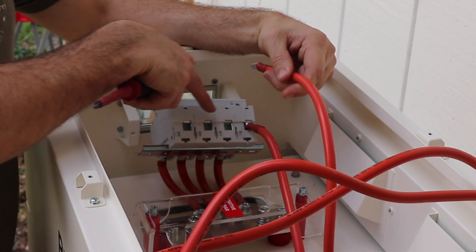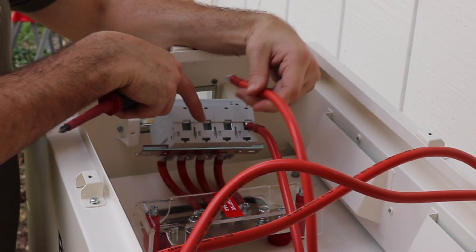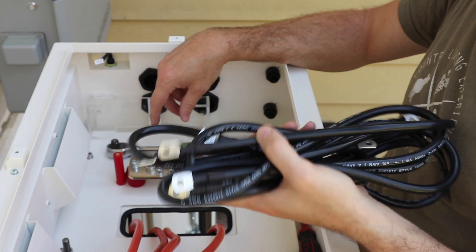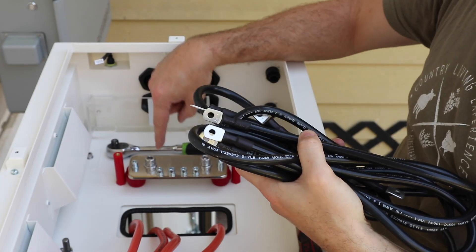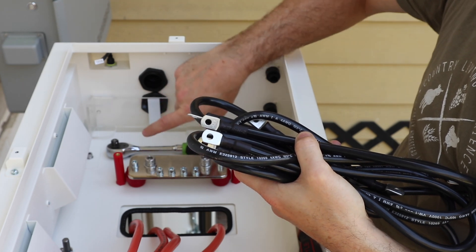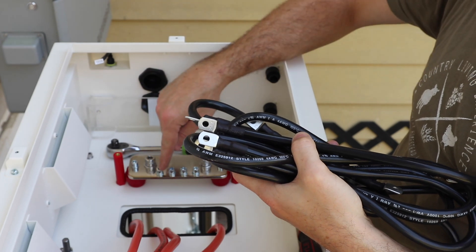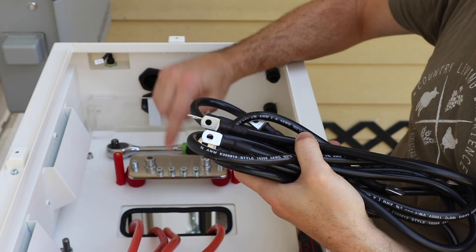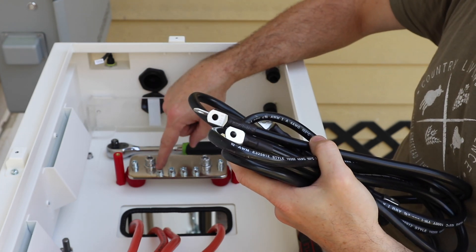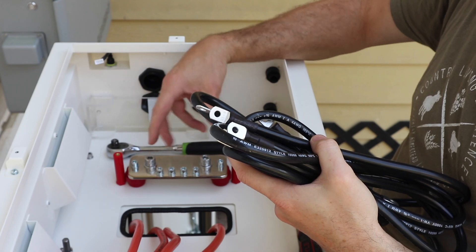This will work best if you put the two short cables on the two outside ports and the two longer cables on the two inside ports. Next, we're going to connect all of our negative conductors or cables to this negative bus bar. These two large bolts right here are for our battery out to the inverter, and these four smaller ones right here are for the batteries themselves in the cabinet. Wire the two short ones to the outside and two long ones to the inside, just to keep things nice and organized.